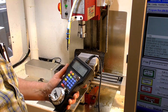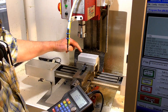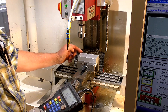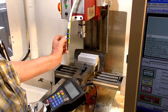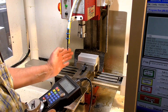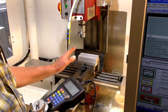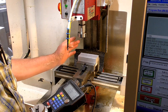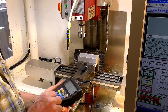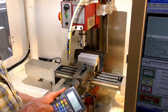The next operation is to set the zero point of the program, which is over here on this back corner. I've got a small pointy tool which I'm going to use to bring just over here and set the X and Y position only — which is the start of the program. That will stay throughout the machining of this whole tool; I won't have to alter it again. The only one we will have to alter is the Z height, because we'll be using different tools. So I'll just put this in position and set the zero in Mach 3.